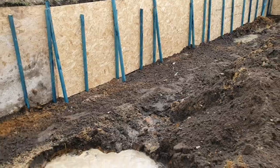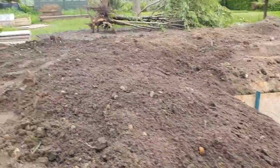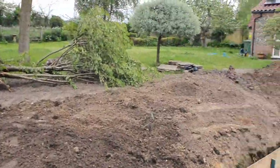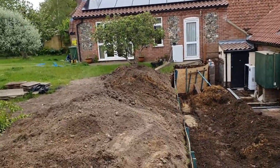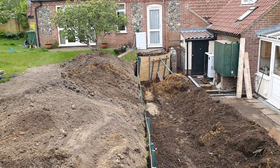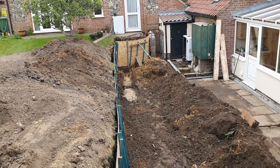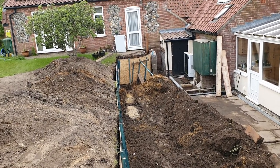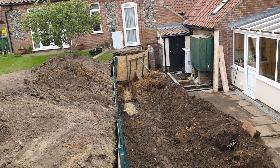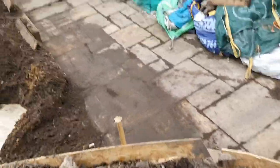I will show you basically when we get to that stage. But the next stage will be when we get the concrete out — I just thought I'd show you how far we've got. As you can see if I go up here, we've raised it up a little bit. Obviously it's all heaped up at the minute, but most of that soil is going to go back in. The timber's there just to support the soil from falling back on us. You can just see that water line up there — that's basically where the concrete footing is going to go. And then behind that concrete footing we're going to put a French drain, felt around and shingled in, so that's all going to go around the whole thing and come down through here and then connect up to that pipe.